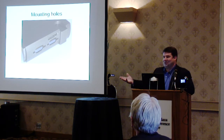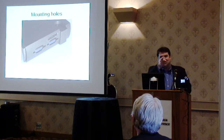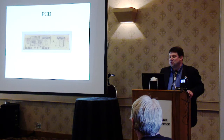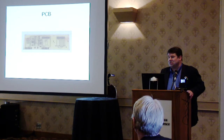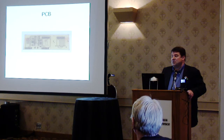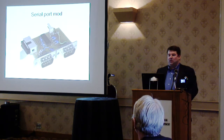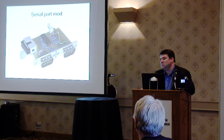If you happen to have a million-dollar milling machine around, you can cut out connectors like this. I sent out the circuit board order to a mail-order PCB place I've used before, and this is what the circuit boards looked like when they came back. I had them perforated between the two sections — on the left side you see the serial adapter, and on the right side the solder pads for the memory card socket. That's what it looks like once it's slightly assembled. There were a couple of adjustments to the wiring, which have been updated in the source files on the website.